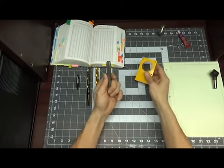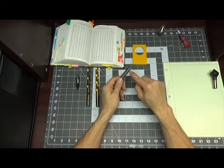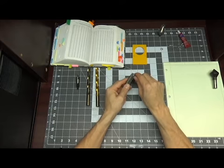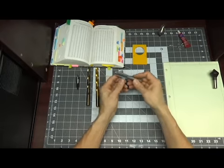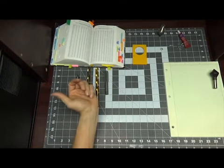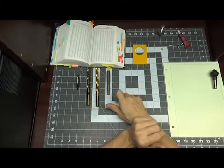There you have these taps that are called bottoming taps. And essentially, after you begin the thread with this regular tap, you go ahead and they are basically flat here, and you can continue on that thread all the way so you get to the bottom. And you specify this in your machine drawings, in your part drawings. That's all good.